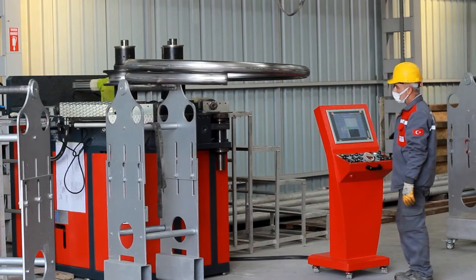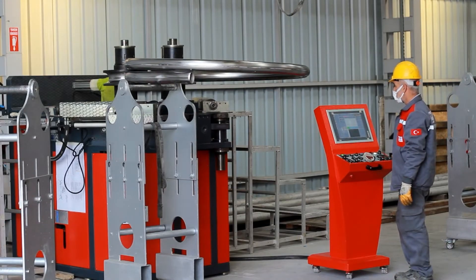As a first step, stainless steel plate is rolled for the fabrication of the heat exchanger shell. The expansion bellows are point welded to the shell, and the baffle cage is reaching its completion.